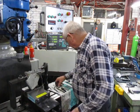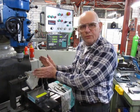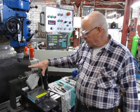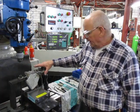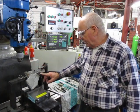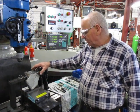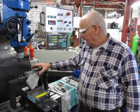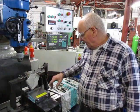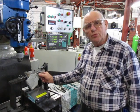So basically, once I've got all this screwed up, we've got a repair here which will sustain the work that's needed and possibly last forever. Who knows? And with a little bit of welding, I wasn't going to go to the work of welding this up fully, because that's a huge job and very expensive. These electrodes are quite expensive. So tomorrow I'll clean this up, and wherever I've welded it, make sure we've got a complete fusion here.